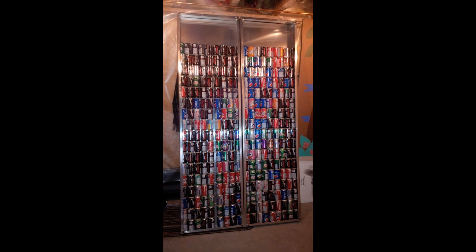Here are 18 separate 17-can solar air tubes for the two 8-foot solar air heaters. Notice the 10 inches of space at the top. When these units are assembled there will be a 5-inch exhaust manifold at the top and a 5-inch intake manifold at the bottom, with the cans occupying all of the center area.